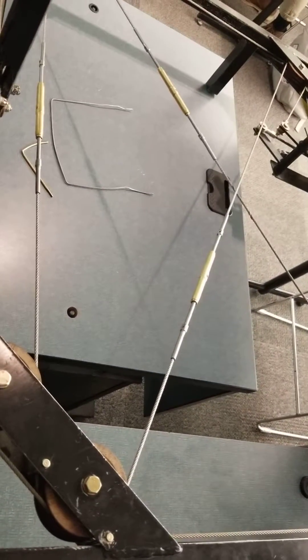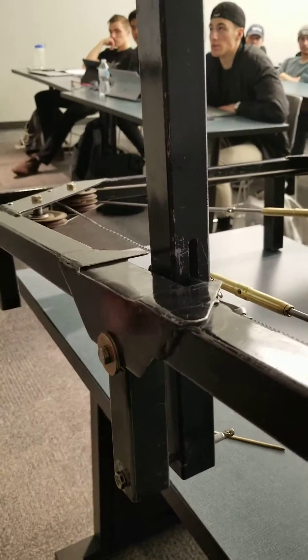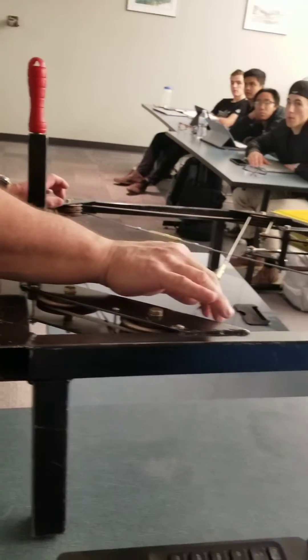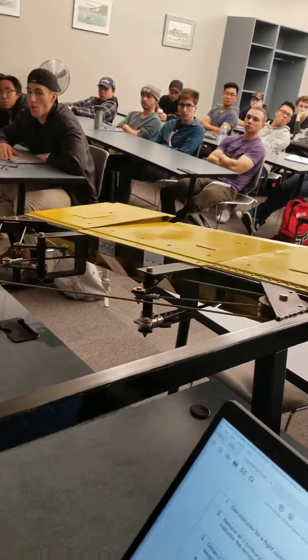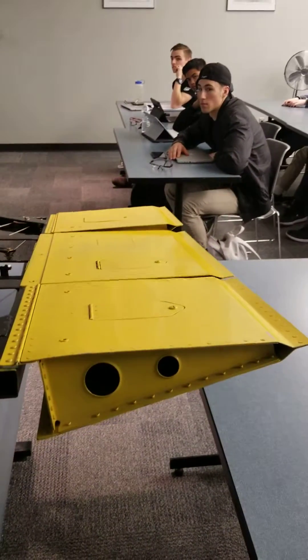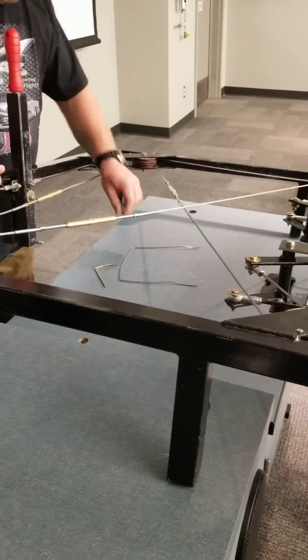When rigging the aircraft, we do supply you with a rig pin. If this is your control column, when the control is centered you want your flight control centered. So if I put the pin in here, my flight controls should be parallel across the back. We've got one sticking up, so we're going to have to adjust these cables to bring that one down. I usually like to squeeze each cable first to see what it's going to do — if I pull on this one that brings it up, so I don't want to tighten that one.